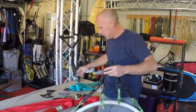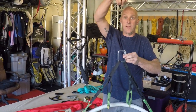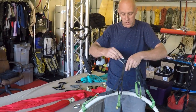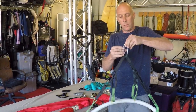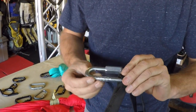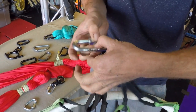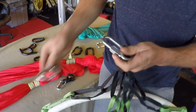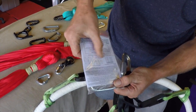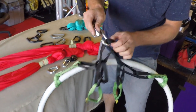The tri-link and the delta-link work great for these three-way loads, especially going up into span set or multiple directions. You can also squeeze into one of these large quick-links — please make sure they're heavily rated. Rating means it has multiple descriptions written on it: who the manufacturer is, what it breaks at, and the different loads including cross-loading on most new ones. Same thing on the tri-links — don't buy the small hardware store ones. Buy them from a reputable company. This is a life safety connector, not from the hardware store.